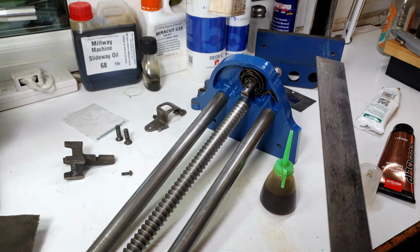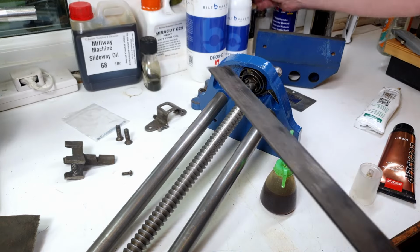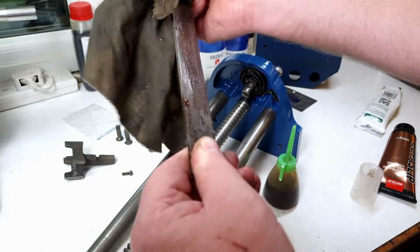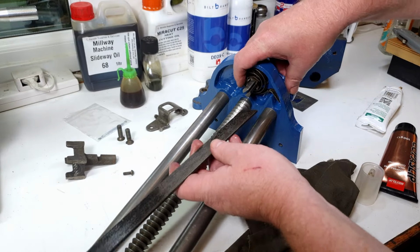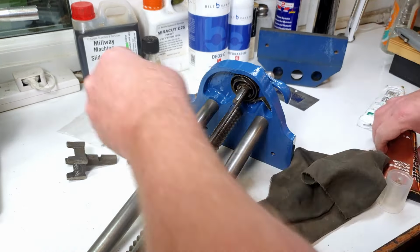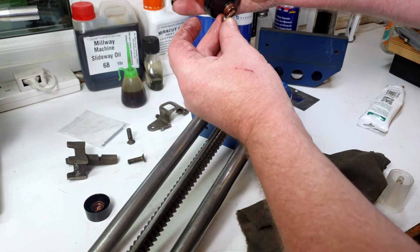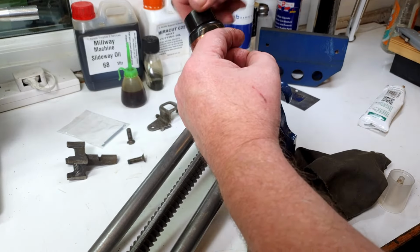And it's a little bit thicker than 3-in-1. 3-in-1's a great handy little oil, but the way oil is a little bit more viscous. It's thicker, so it sticks better. So I'm just going to use a little bit of that on here again, maybe just to stop it rusting, really. So we'll put a bit of that on both sides. And I've got the ubiquitous oily rag, so we'll just give that a little bit of an oil. That's all it'll need. Now this attaches via a screw. That's the threaded side, so we'll pop that on there like so. What I'm going to do is put a little bit of copper slip on the screws. Don't need to, I just like to do it if I'm assembling something. A bit of anti-seize compound, so that the next bloke that works on this in 60 years' time is going to take it apart and admire all the care that went into putting it together from the previous bloke, and he'll thank me for it.